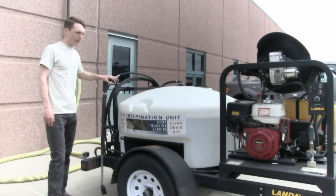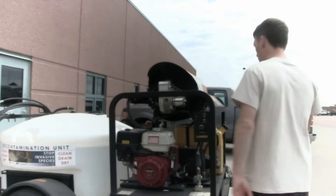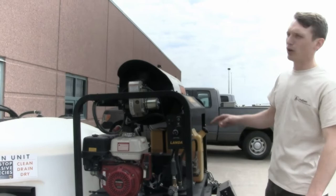Once we are done, we're cooling this down before we're killing the motor. Before you ever leave the site, we want to make sure that we have an adequate amount of diesel, gasoline, and oil in our unit before we even leave the shop and that this is full.